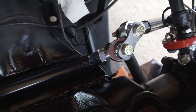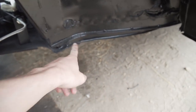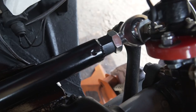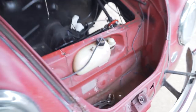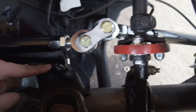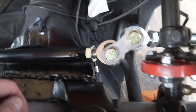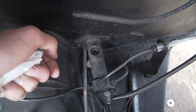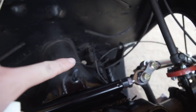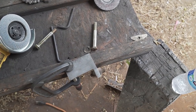Checking the steering angle - it starts to hit right there, but look how much angle is on this - the car will never see this much angle because the tire rubs on the body before it would ever get that far. Going the other way it's rubbing the bolt right there, but again look at how much angle is on this tire - it's going to rub before it ever reaches that point. So I'm not stressed about that. One thing I did mess up though is when I was bending the brake line to match this plate, I messed up the seal that goes in there. It was old and leaking a little anyway, but bending things ripped it even more and it started leaking really bad. I need to get a new seal - and since it's Labor Day I can't go get one today.